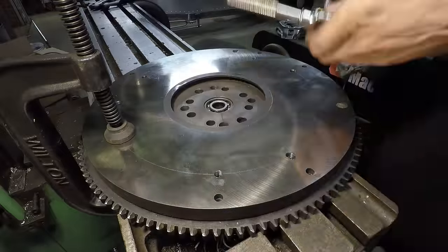But what I did is quite simple. All you have to do is rotate it just like that. And then I could pick up this piece, rotate it right there. I drilled two new holes in this for these alignment pins. Fits on just like that. And then super easy, I put this on my mill and drilled and tapped all new holes in the bell housing to match up with the holes on the hogshead right here. So now my clutch linkage is back at horizontal like it was, and I have room for my starter up here. Pretty simple.